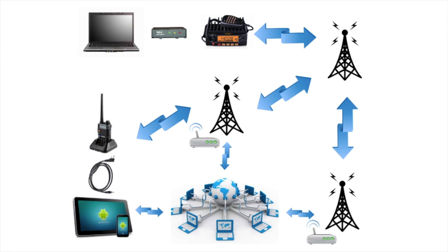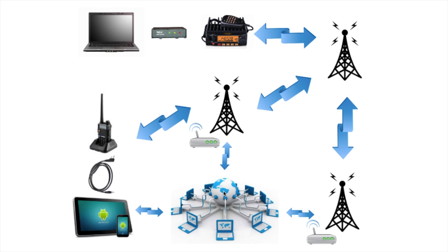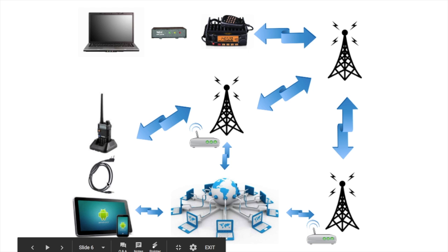Let's talk about the network topology of APRS. In the lower left-hand corner of this diagram, you can see an Android tablet connected via cable to a Baofeng radio. We connect over RF to what's called a digipeater. Some digipeaters are connected to the internet, and some are not — but they can still broadcast your APRS information. Along the top, you have an example of another station using a laptop and a TNC, or terminal node controller, to interface with a radio that broadcasts an FM signal. You can use all kinds of laptops, TNCs, and radios, and you can probably cobble together most of the station with equipment you already have.